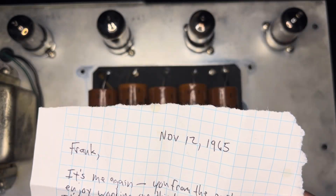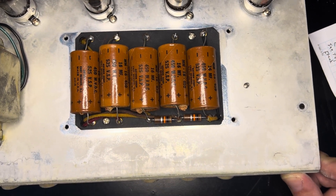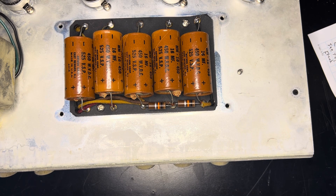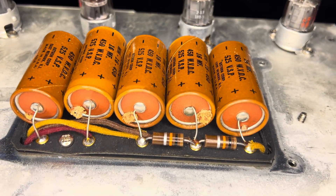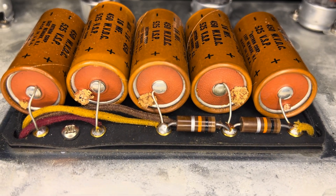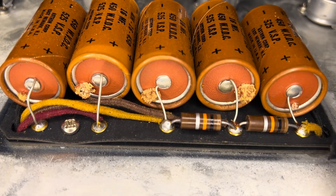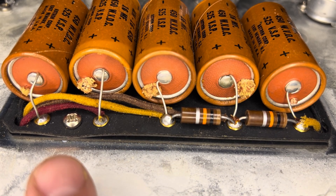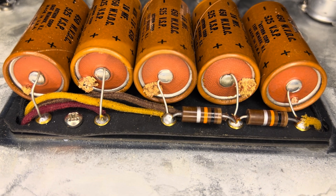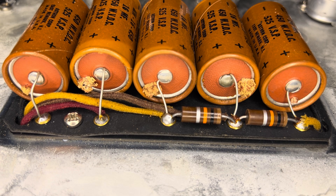What a douche. What a waste of time. Anyway, let's get down here and look at these caps. You see that? That's not cauliflower. The material inside of these electrolytic caps — the electrolyte itself — has started erupting out of the vents, and every one of them has the funk. We need to get these out of here. Some of these are obviously physically leaking; they're probably electronically leaking as well.